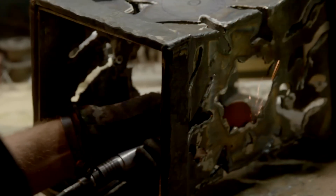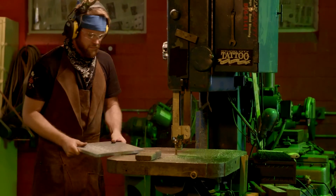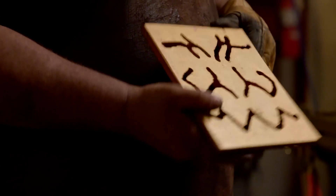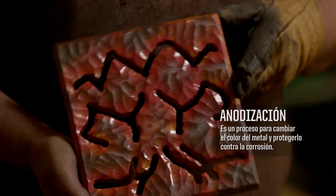A plasma cutter can achieve temperatures of 45,000 degrees Fahrenheit — it vaporizes the metal underneath it and cuts a channel. After Brian has plasma-cut the channels, we'll take the scale and flash off using a die grinder. For the end caps, Brian will cut out 5/8-inch aluminum on the bandsaw, then bring it over to the vertical mill and mill out the fire channels. We send the aluminum out to get anodized — a gold anodizing finish with red highlights. There are so many layers to it, and I have to make it glow.